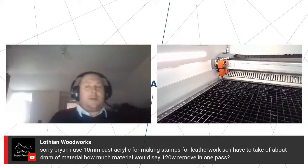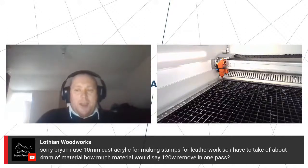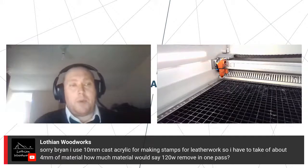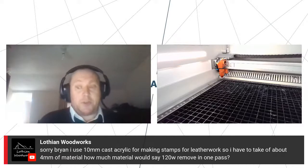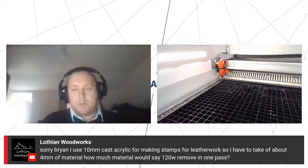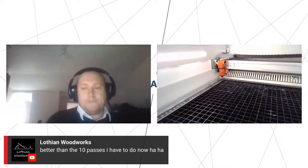Okay, so he's using 10 passes at the minute. So yeah, I would say the fineness of beam allows for better vaporization. I know you're using K40s, so you're going to get a much finer beam and therefore better vaporization. So you should be able to take the material away much cleaner, and therefore you do it in far fewer passes, I would say. Absolutely. Even if we're running at 10 passes, we're probably going to be still 3 times as quick, obviously, seeing the speeds of our engraving.